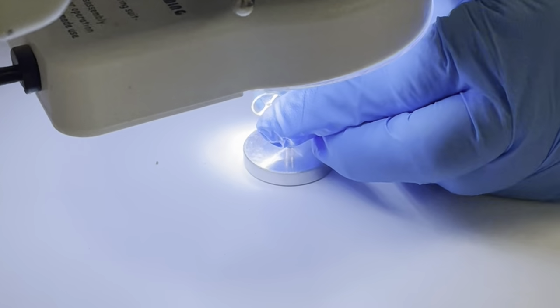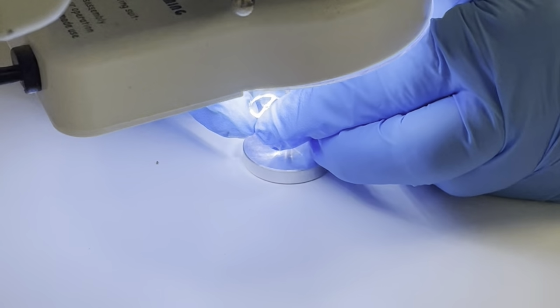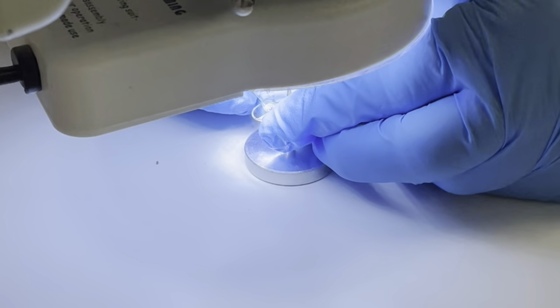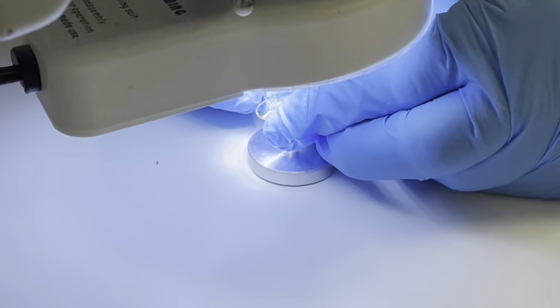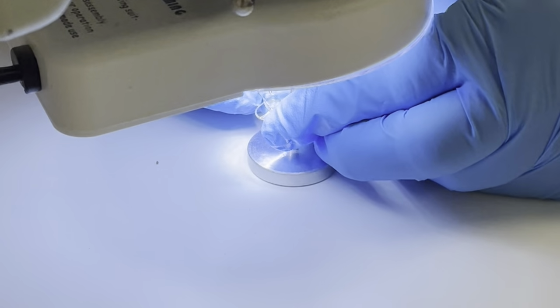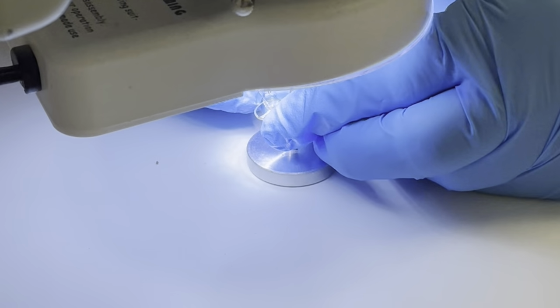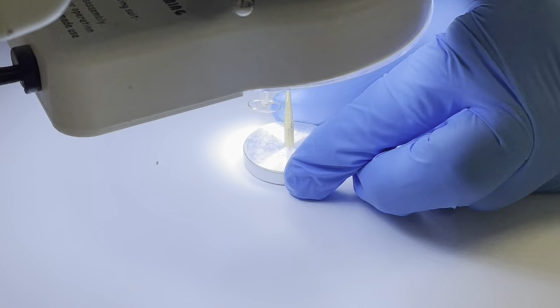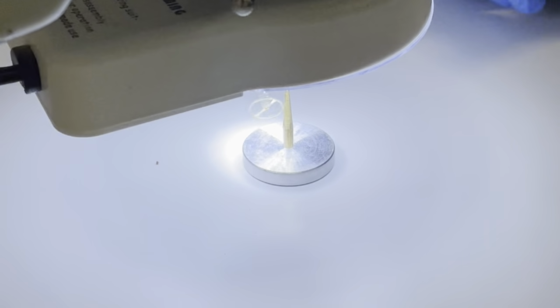So what you do when you're adjusting the collet is you need to get access to the collet. So you go in between the hairspring springs and you take a screwdriver to the little slot in the collet and you twist it either clockwise or counterclockwise depending on which direction you're adjusting the beat error. So at this point I've adjusted it clockwise and let's see what it does.